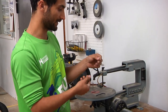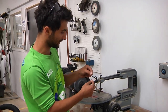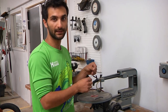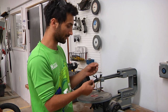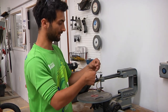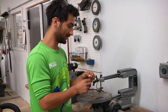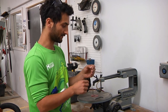So we'll just put this one back in. When you're putting it in, it's important to make sure that the teeth are facing down, so it's cutting when it's pulling down. This blade looks fine to put back in. If for your particular project you want a different kind of scroll saw blade, you're more than welcome to go out and get them — they're pretty cheap. There are different kinds with reverse teeth, hooks, and different set, which is where the teeth are at different angles coming off to the side. These are just fairly traditional scroll saw blades. It's important when you're buying them that they are scroll saw blades, which means they don't have pins coming off the sides — that's for a different kind of saw.